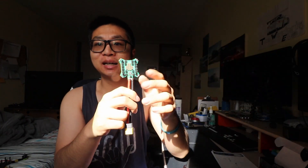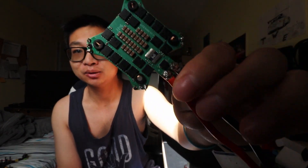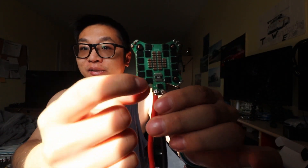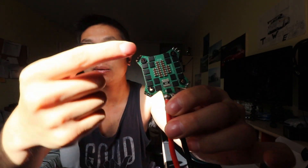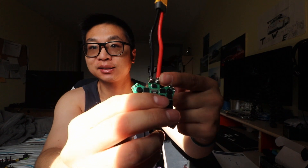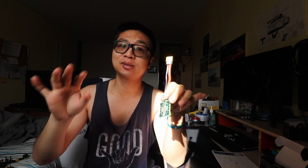It's the next morning. Now that we have the ESC kind of assembled — we have all the stacks, the gummies in, the rubber bases, the pre-soldered joints on top of each part, and the XT60 soldered in as well — we can now drop it into the Nazgul and solder the motor wires together with it so that we can test if this ESC works.